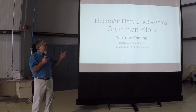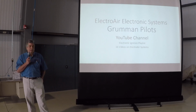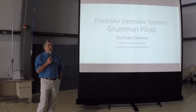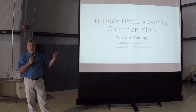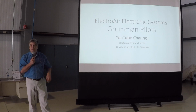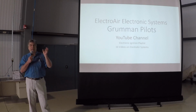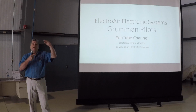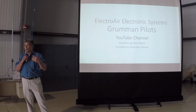Yeah, on every system that I've installed, I run a shop out of Butler County Regional Hogan Field, Yankee Aviation, and we have installed, like I said, 11 last year and 2 this year, and every customer, I said, now if you don't like it, bring it back. We'll take it out of your airplane. So when we disable it, we take the right mag out, we just take the mag grounding leads and we wrap them back into a harness and leave them there in case you ever want to go back to a magneto. We don't pull the wiring out.